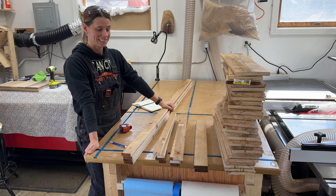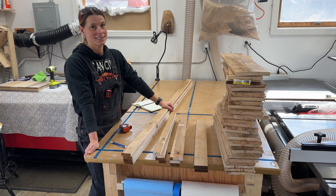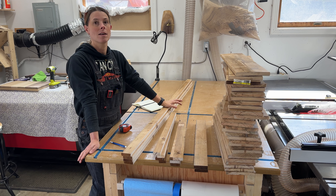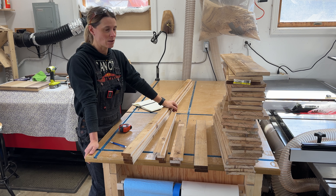To get started with this planter box building, I highly recommend that you make all the cuts as per the cut list, but only start by cutting the ones indicated in yellow. The reason for that is you can make some small adjustments later on — if there are any mistakes, you don't want to cut all the pieces just yet because some things can be hidden if mistakes are made.